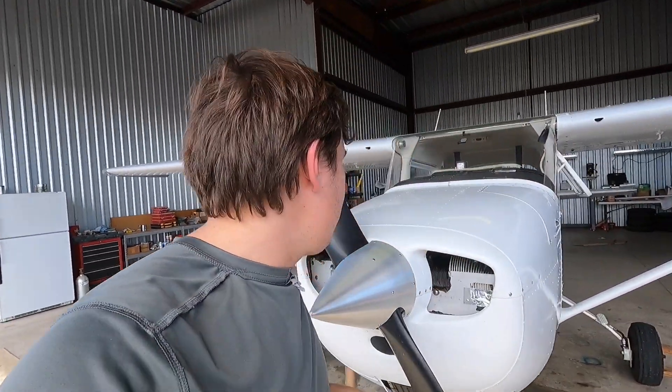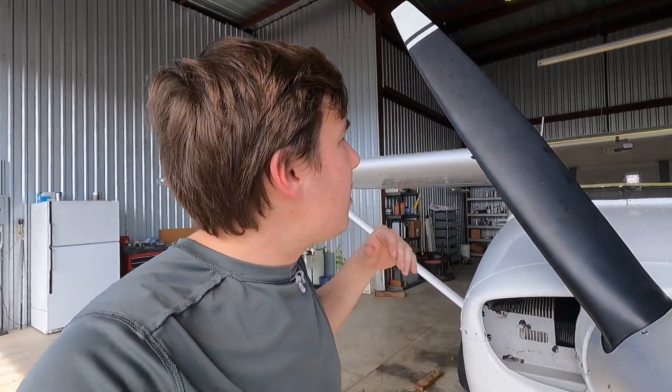The second rule seems very self-evident but it is true: you do not want to stick your hands up here and start moving the propeller. When you walk up to an aircraft it is a very bad habit to start moving the propeller, especially this one, because I just finished running the engine which means the engine is warm and there could be a leftover fuel-air mixture in the cylinders — so if you rotate it, it could go off.